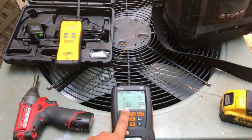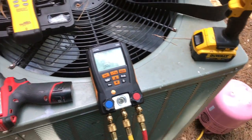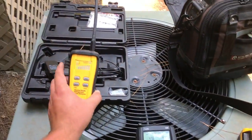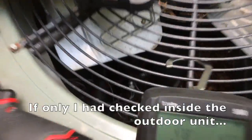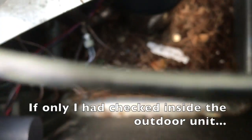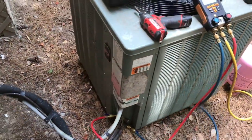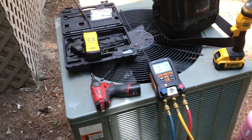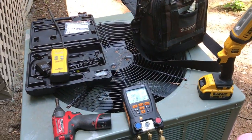Okay, 136 PSI standing pressure in the unit, 410A. Got the SR-L8 wound up. I've went over everything out here, haven't really found anything. I don't really see anything in the bottom down there that would be indicative of a leak. But knowing this manufacturer, I'm going to have to guess it's probably the indoor coil, so I'm going to brave the crawl space now and see if we can find a leak on the indoor coil.